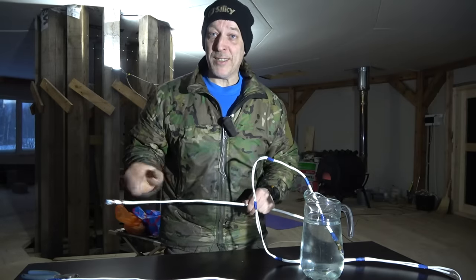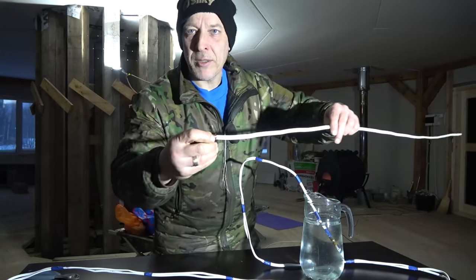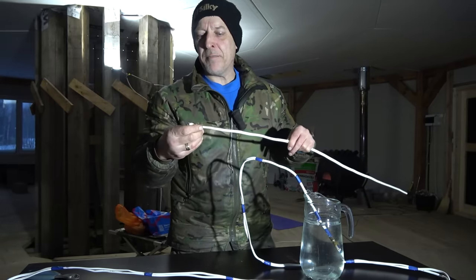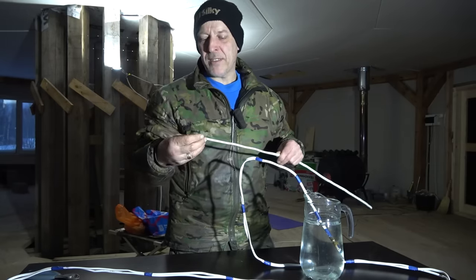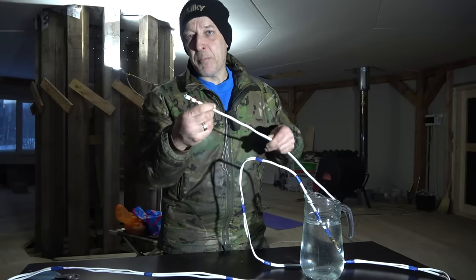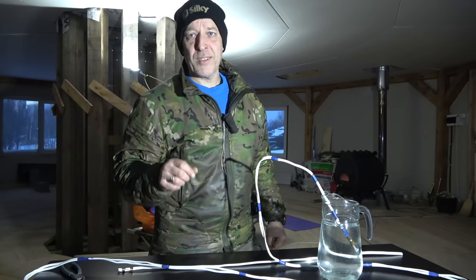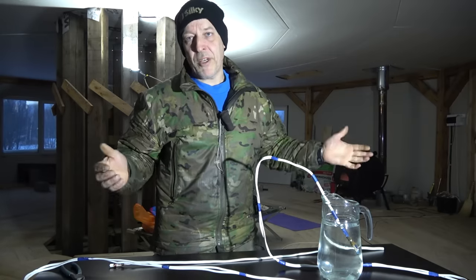If you're using it in a drain pipe, something can happen. That's simply because in a drain pipe you have all sorts of fats and disgusting stuff. There was a big clump sitting there that made a connection. But when I pulled it out and touched it, it wasn't really that warm — it was just burning some residue a little bit. And if it burns off the insulation, the safety relay will definitely cut it out because then you have a 100% short circuit. Do not use this in metal tubes — I don't recommend that, because a metal tube can make contact between these two windings. For metal tubes, you have to do something else.